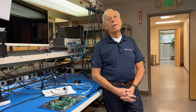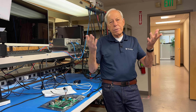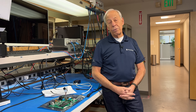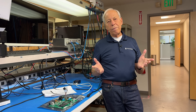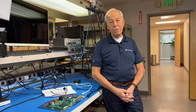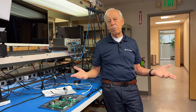Let that speaker run full range. There's a whole bunch of reasons. Phase shift being one — when you start filtering those low frequencies out, you're going to be adding phase shift to the upper frequencies. You are going to change the contour of your speaker from what the designer wanted to what you have. I have never personally heard a high-pass system sound better than one that was let to go full range. My advice has been constant: don't roll off the bottom of your speaker. And if your speaker winds up sounding better being rolled off, I would recommend you get a different pair of speakers, because that's not very well designed. I would never do that to an Aspen pair of speakers. Those speakers are full range — they are designed to be full range, they are intended to be full range. Let them roll. Let them do their thing.